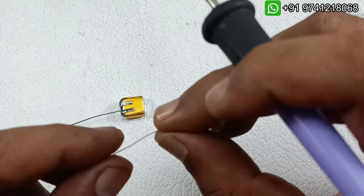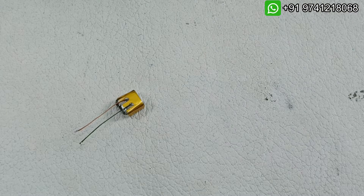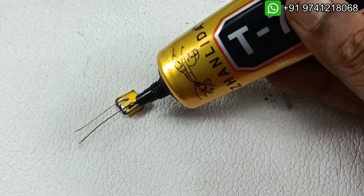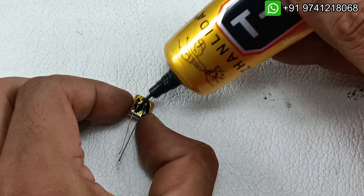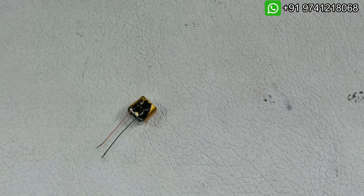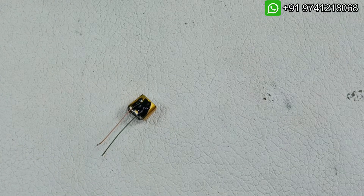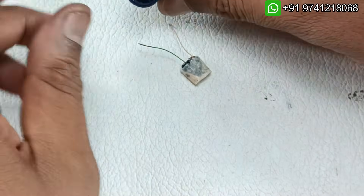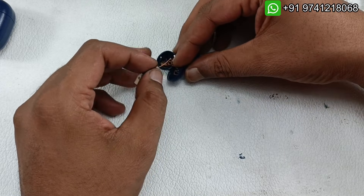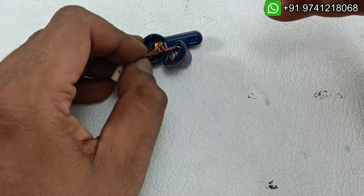For plus I am connecting the green wire, and for minus I am connecting the gold wire — done. For insulation I am going to apply some glue, very mild, and I will also apply tape on this so the terminals do not move. The glue will take five minutes to dry, then I will cover it using insulation tape. Battery is ready — I am going to solder it to the board. Don't forget: plus will go to B plus and minus will go to B minus.